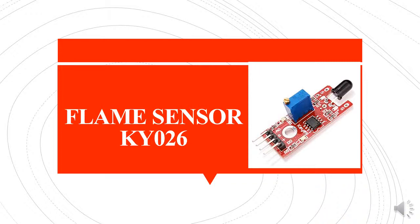The operating voltage is between 3.3 to 5 volts. Then it has digital and analog output. The DO pin gives you the digital output, between 0 and 1, whereas the AO pin will give you the analog voltage output, which we'll see in the pinout description.